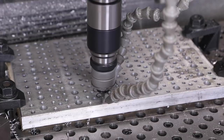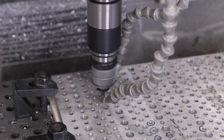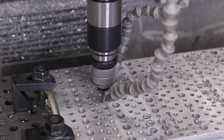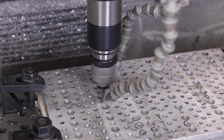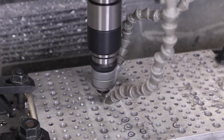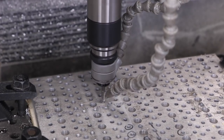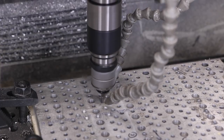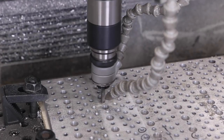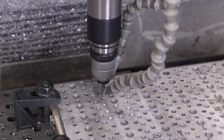All right, tapping some quarter 20. I don't think I have ever tapped this many holes in one setup. I'm only going 0.4 inches deep because I don't need to go all the way through. And frankly, and maybe I'm being a chicken here, I think that would increase the likelihood of breaking the tap, you know, due to it clogging up or something. And once it's tapped and started straight, I would have no problem running it a little bit deeper if needed, but I don't think we will. So it's working pretty good so far. We'll keep running and we'll be back to thread mill, which we'll finish up in this fixture position.